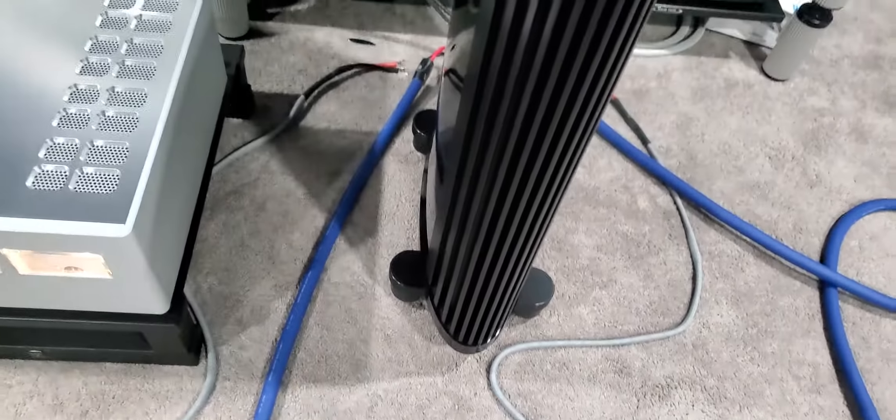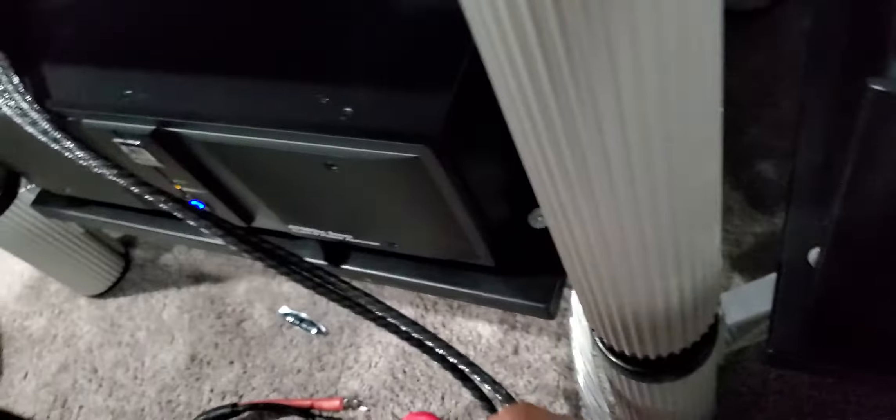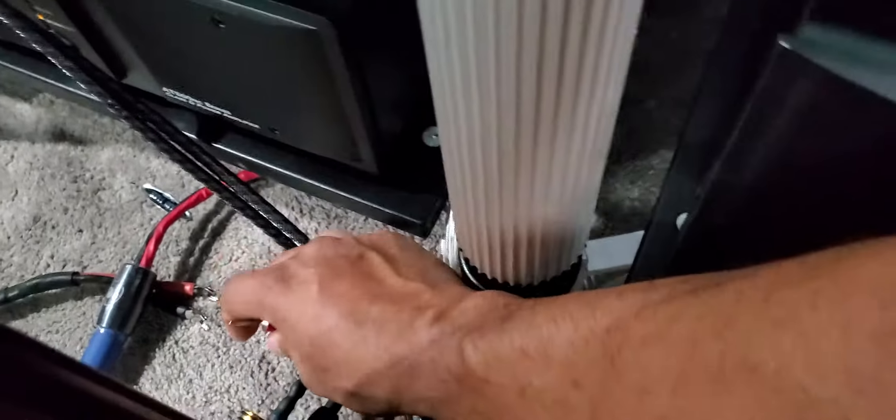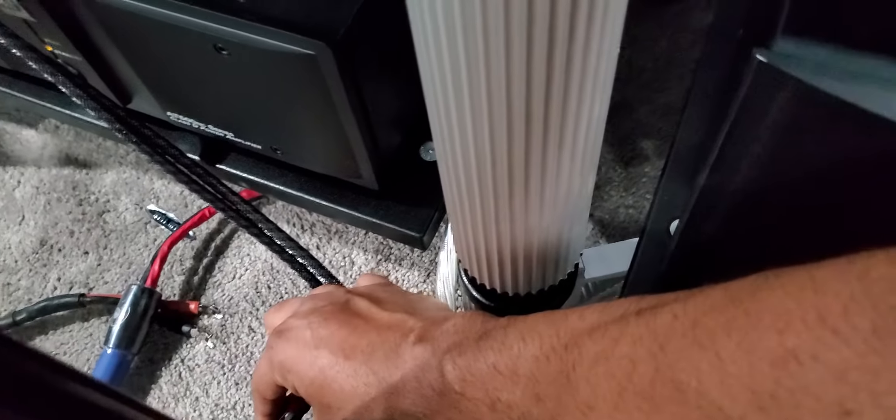Nothing on the right channel, but if you hear background noise it's because of the left speaker. I thought maybe that left speaker cable is busted, bad, or has a bad solder. So I'm going to change these — I want to see if when I connect the right speaker into the left binding post, the problem continues on the other speaker.